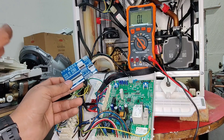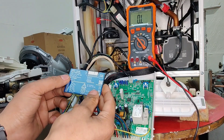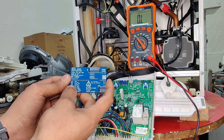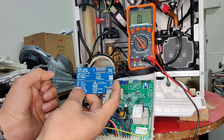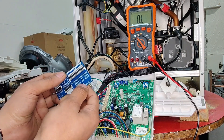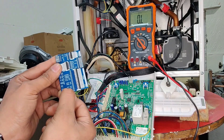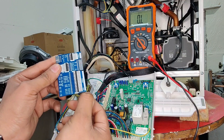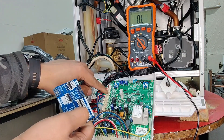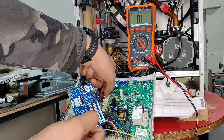The next step is to do some testing. We're going to assume that we have a fault code on the boiler showing E40, which indicates that the return thermistor is faulty. The return thermistor, if you look at the card, is on the X22 connector. The X22 connector on the PCB is this large one here, so let's remove it.